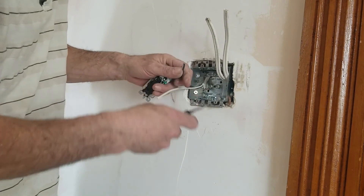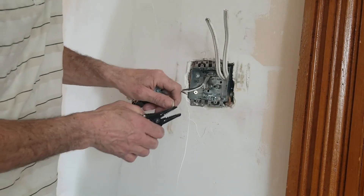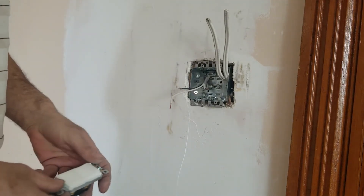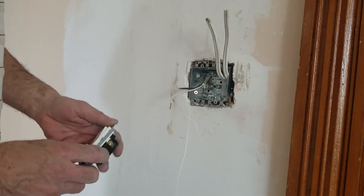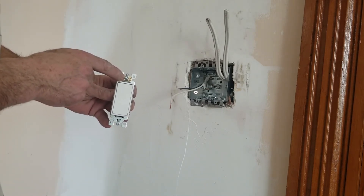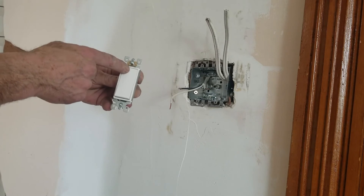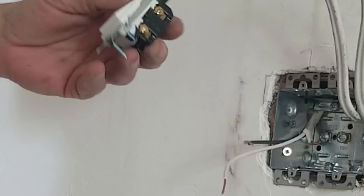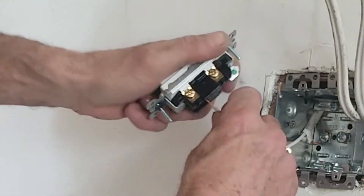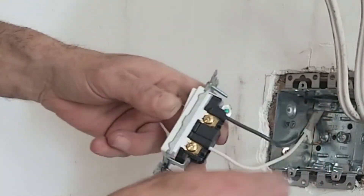When I make these connections, remember that we connected the white wire to the power source or the hot on the other side. The hot goes inside because I want it to be on the bottom. These things are really cool — the little gold part, that's always the top. So if you put this in the top, then on is pressed here and off is pressed there. The white goes in the bottom because that is our power coming in, and the top is where it's going back to that outlet.